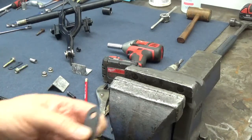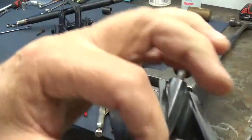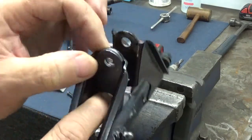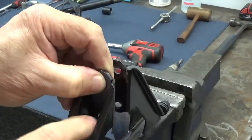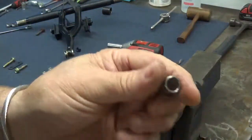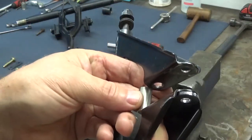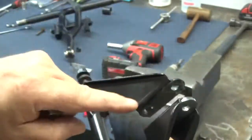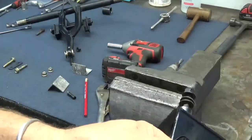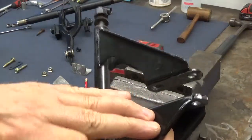I've come up with these plates, and they fit in there pretty well. They're going to beef up the material — more than double the thickness — and they'll be clamping at the bottom. There's also a sleeve that we're going to install in here, and that's going to stop the arm from collapsing down at the bottom, bonding and sandwiching between this part of the arm and that part of the arm.